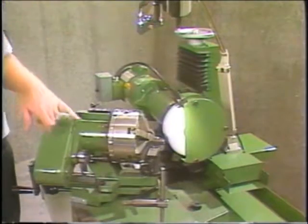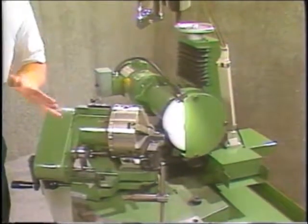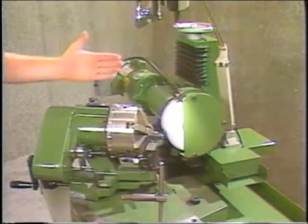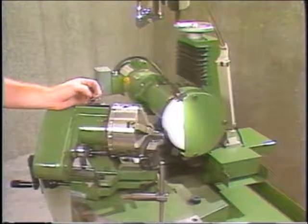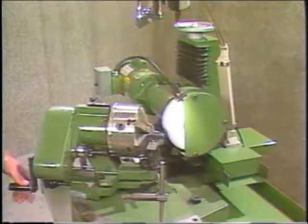As far as the cam relief, you would set that at about 10, 12 on the cam drop, and the angle you want to set it at for most core drills would be not at 118, but set at 10 degrees further to the right. It's 128. Now the reason you don't set it at 118 has to do with the oscillation of the workhead.